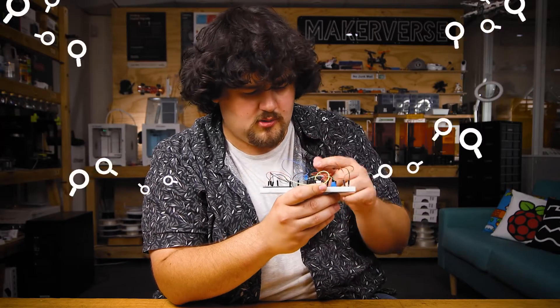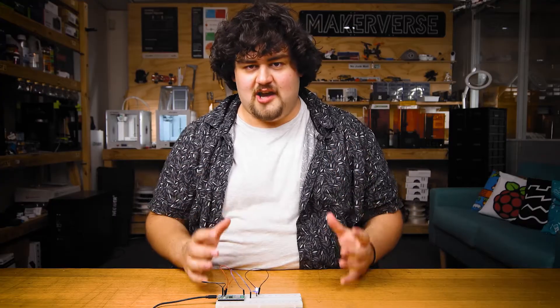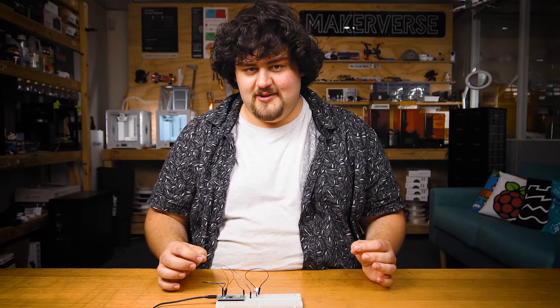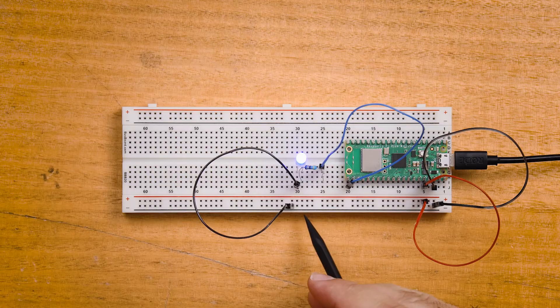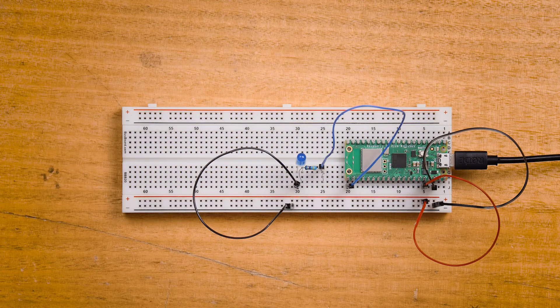Right now I've got that code running, and this is a good opportunity to introduce the concept of a closed circuit. A closed circuit just means that you create a nice loop for electricity to flow in, and it's vitally important as without it nothing is going to work. We're also going to introduce voltage and current, which are often a bit tricky to understand at first, but a very common analogy to use is water. Imagine this circuit is a sort of water system instead of an electrical system. Our Pico starts from ground or zero volts and outputs 3.3 volts on pin 16 — you can think of voltage as kind of like water pressure.